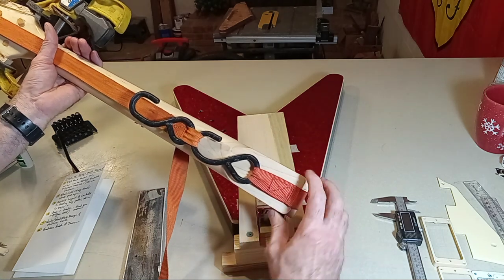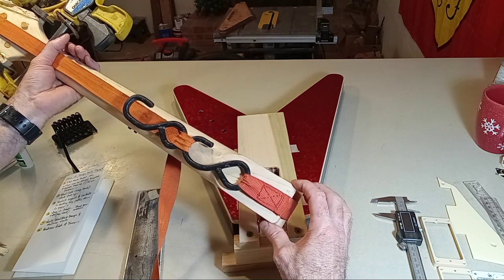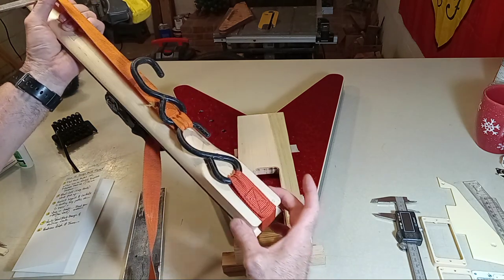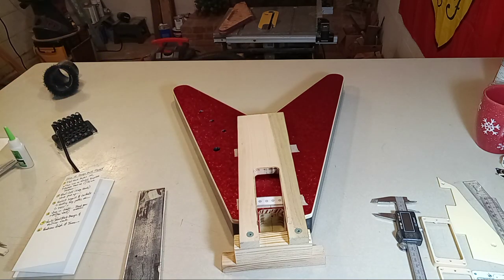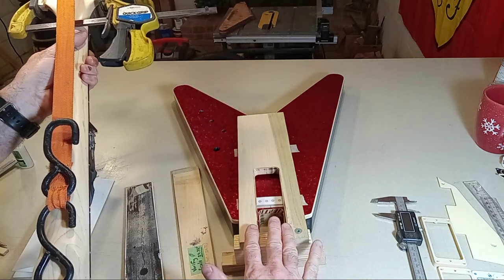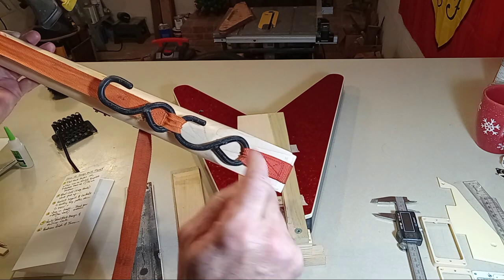One of the main reasons I bought this neck is because it's actually two and one-quarter of an inch wide at the heel — a huge plus. So I got a Fender-esque type neck but with a nice two and a quarter inch width. The fretboard has a trapezoidal path, and when you're doing a tapered pocket, you want to route out that neck pocket to mimic exactly what's going to be installed in it.